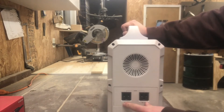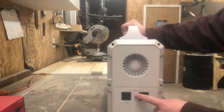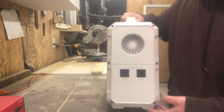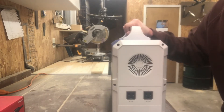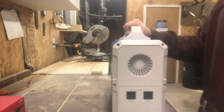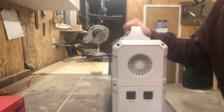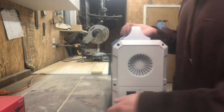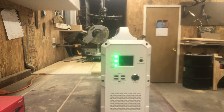On the back side you've got the fan and two standard 110-volt AC outlets, rated at 1000 watts. I'm sure somebody will critique this, but this is how we plug our cabin in — everything is Romex wiring tied to a 12-gauge extension cord that we plug straight into this unit. Since we're only running a few lights, a fan, and a TV, we've never had any issues, though I'm sure someone would say we're going to burn the place down. Works for us.